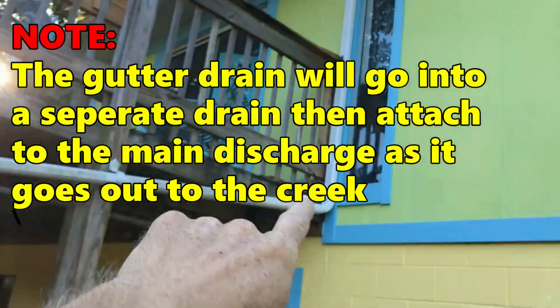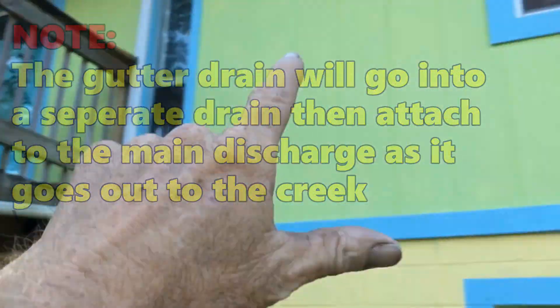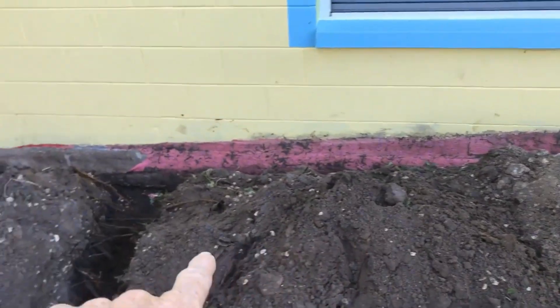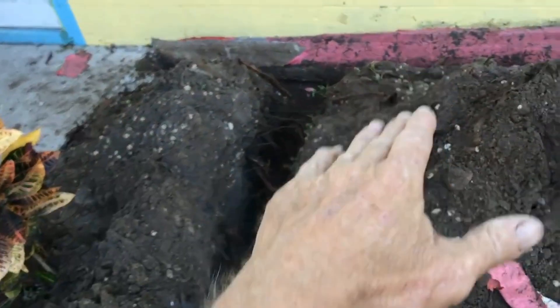In addition, we're going to come back and put new gutters up. You can see this one just covered the porch but the discharge looked a bit awkward. We'll put new gutters up, bring the downspout down, and retrench right on top of our footer pipe with a solid pipe, attaching it so that water does not go back up underneath the floor.